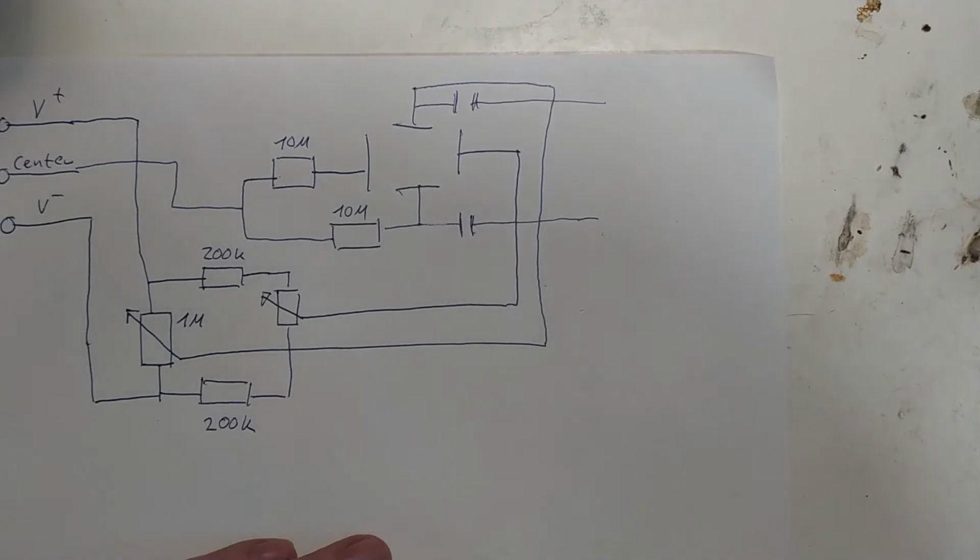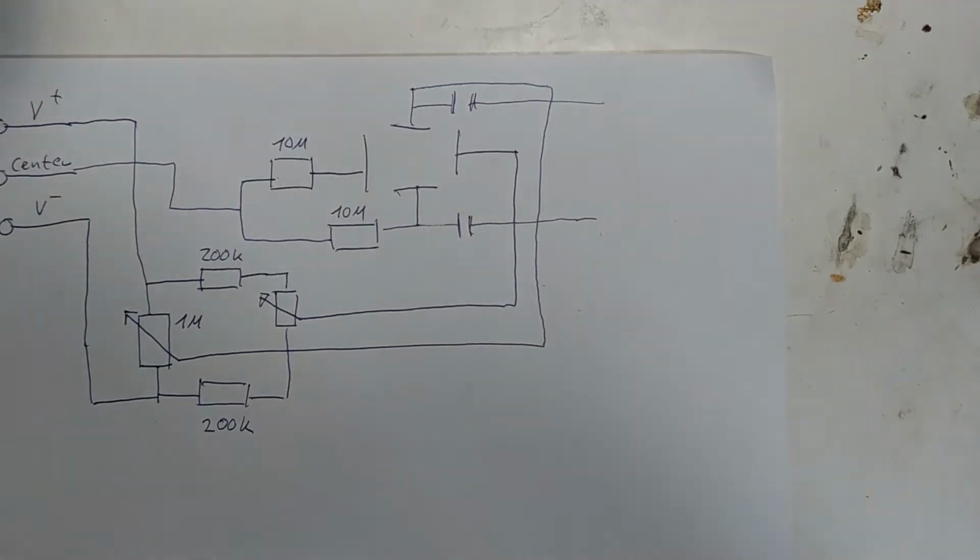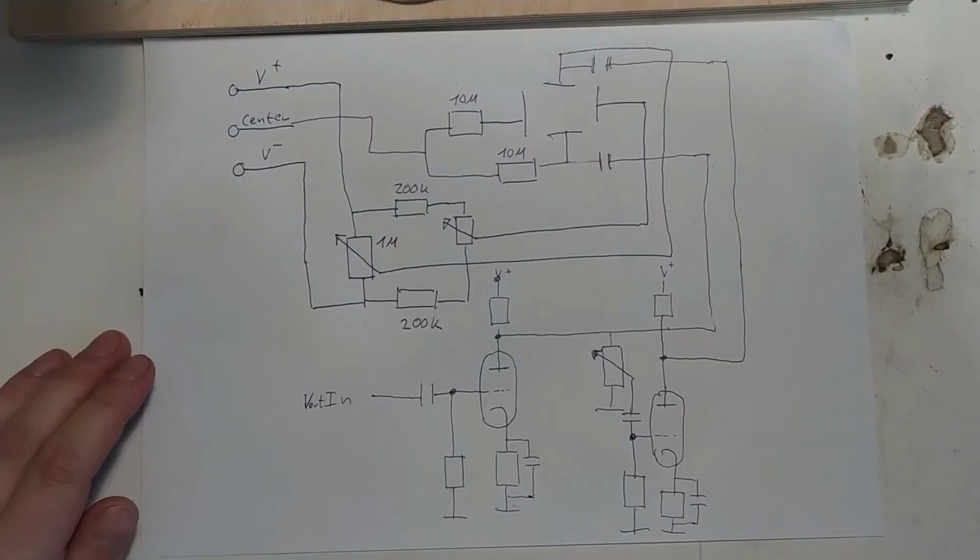We can borrow from the amplifier community here. They need phase inverters all the time, or differential amplifiers, to create push-pull circuits with vacuum tubes. And you could use an AC long-tail pair, for example, but I decided on using a paraphase inverter. This is what this inverter will look like.